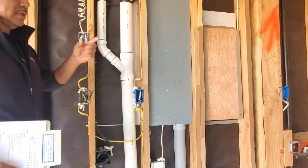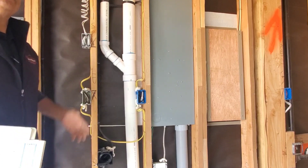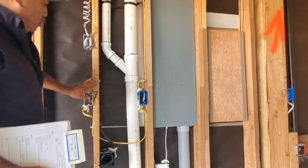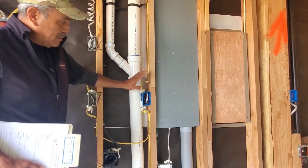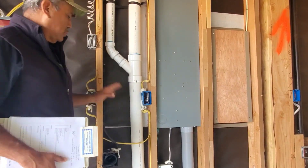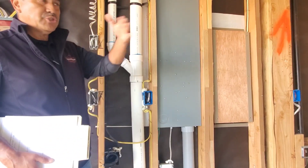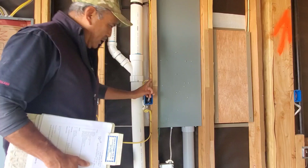As of 2020 and newer, electrical codes changed — all garage outlets are now 20-amp. This one here will be your garage GFI outlet. This outlet will control these outlets and the standard garage outlets. Any additional outlets you pay for will not be controlled by this GFI.